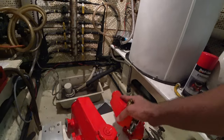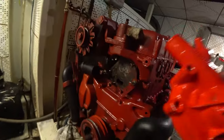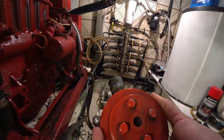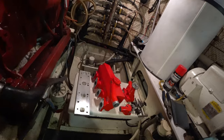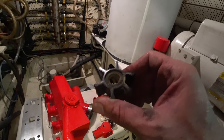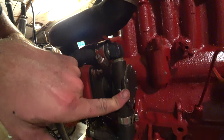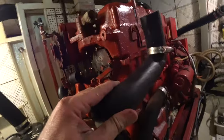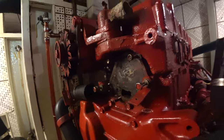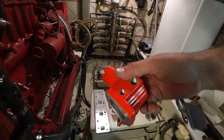And while we're at it, we've got a new mixing elbow. We've got a new circulation pump — the old one, the wheel started to have a little bit of a wiggle, meaning the bearing was starting to go bad and it was actually starting to seep a little bit, so we got a new one. I went ahead and put a new impeller in — here's the old one, it's been in the boat since before I bought it over a year ago, looks pretty good. Here's the raw water pump, just finished with that. We've got new hoses going to the exhaust manifold and the heat exchanger, a new hose to connect to the circulation pump, and this is the thermostat housing — I have a new one of those, all nice and shiny. And a new thermostat.